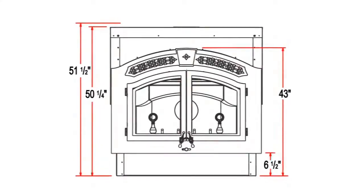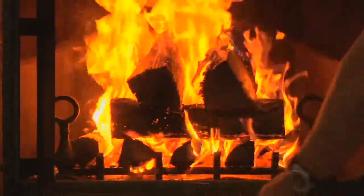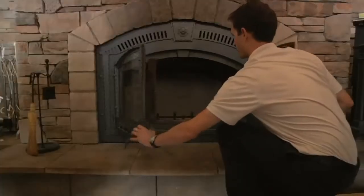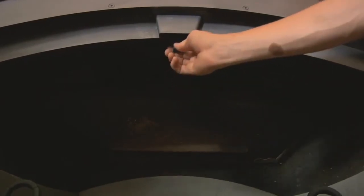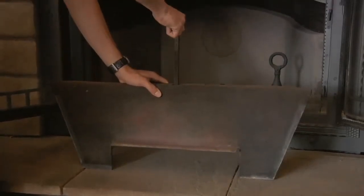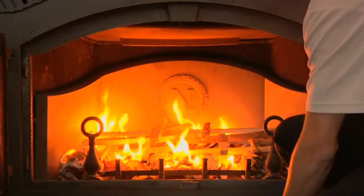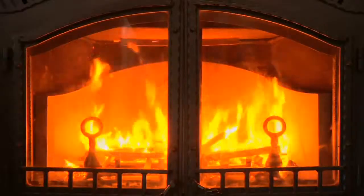The NZ6000 is a big fireplace with a big chimney system. Depending on the height of the chimney, it may take some special attention to help get it heated and draft established. Building a hot starter fire is a great way to begin, but another feature of the NZ6000 that can help you is the bypass baffle. Like traditional fireplaces, you can open the damper in the bypass baffle to allow more heat up the chimney or close it for a more efficient burn. When first lighting your fire or during poor weather conditions, this can help you establish draft and get your fire roaring.